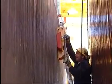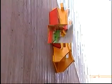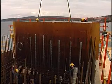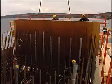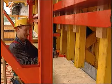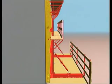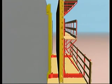The climbing shoes are bolted to the anchors after striking. The pre-assembled climbing unit is mounted. The formwork is now lifted and connected to the climbing unit. The formwork panels are secured with strongback connectors. The formwork is now aligned. After the second pour has been concreted, the formwork is retracted and the climbing rail installed. The formwork can then climb.